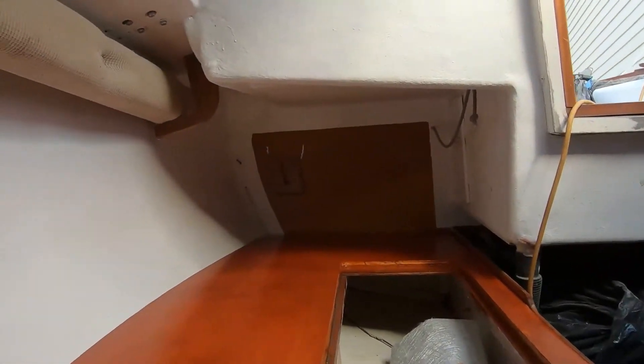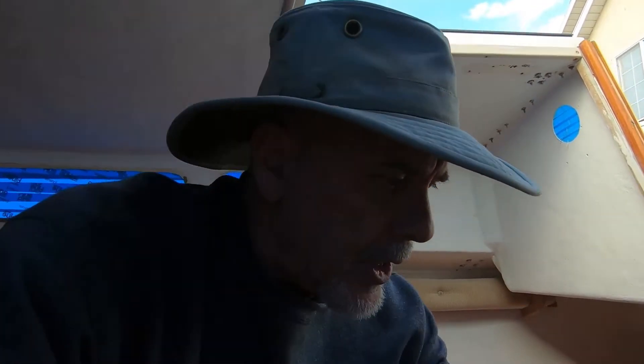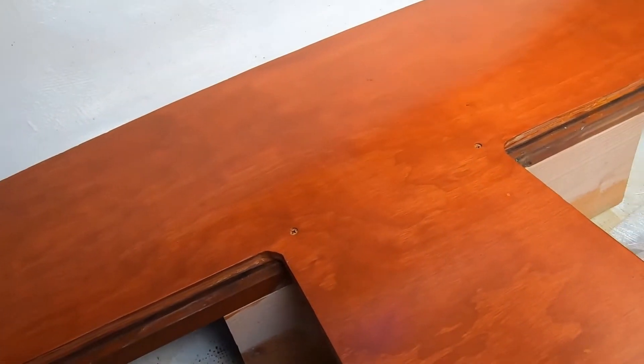Okay, well I've just come up in here to check on the progress of the polyurethane, so let's see how this looks so far. Ooh, shiny! Does not look too bad. However, it hasn't been very warm and so it didn't really cure the way I expected it to. I thought I'd be putting another coat on today, but as it turns out I've had to put this little heater in here to try to warm it up a little bit. Just feeling a little tacky. Feeling much better now. I think we're making progress but I'm gonna let this dry a little bit longer and then see about doing another coat. I think that is looking not so bad.